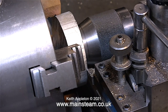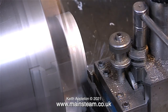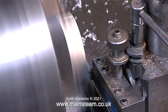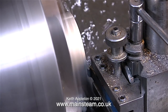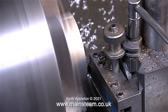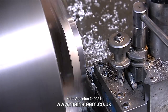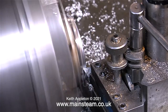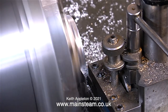To start the machining operation I'm using the tailstock chuck to position the blank in the four-jaw chuck. I'm using my old Smart and Brown 1024 lathe, which is the larger of the two lathes that I have, mainly because this blank will not fit in the three-jaw chuck on my Boxford lathe and unfortunately I do not have any outside jaws for that chuck. The first part of the job is to take a facing cut across the aluminium bar, and I slowed the lathe down when cutting on the outside edge. This is the part of the aluminium cap that fits into the copper part, so I need to turn it to an accurate fit.